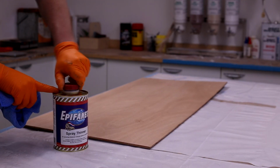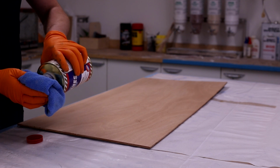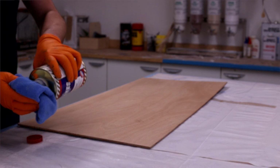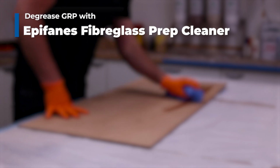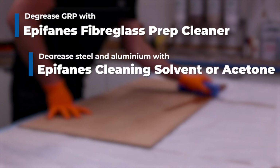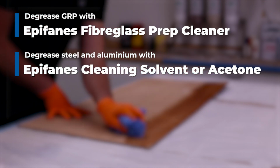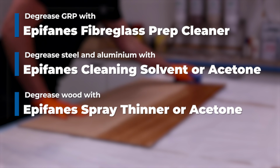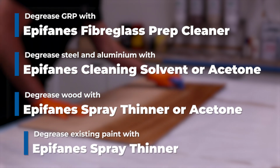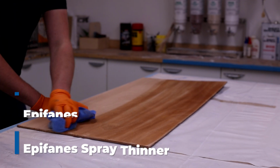Begin preparation by degreasing the surface. This can be done with a number of different products depending on your substrate. Epifanes fiberglass prep cleaner should be used for fiberglass or gel coat. Epifanes cleaning solvent or acetone can be used for steel and aluminium, and the Epifanes spray thinner or acetone can be used for wood. For existing painted surfaces, the Epifanes spray thinner for single part paints should be used.